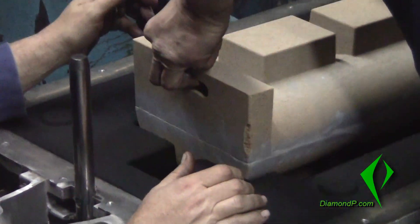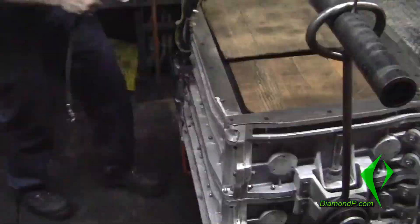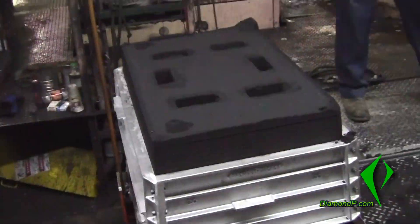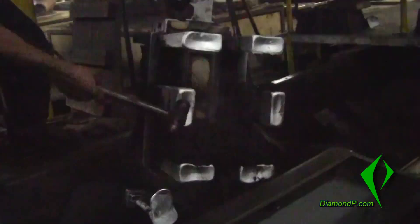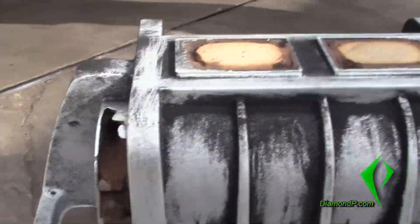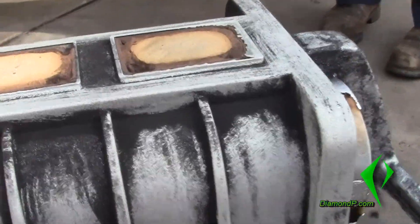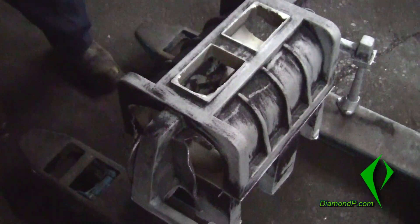Now the molder is setting the core into the mold. Part of the video that you didn't see was the cores being put together and glued together, and these have actually been hollowed out a bit to make it easier to knock out. Now I just need to pour the metal, wait for it to cool, and shake it out. The black on the casting is just green sand — it'll be cleaned off when it's ground and shot blasted — but you can see the core sitting inside of the casting. All we did was take a hammer and hit it a few times. That's how a core works.